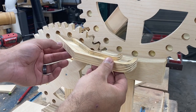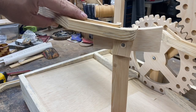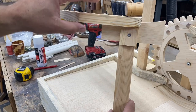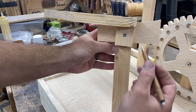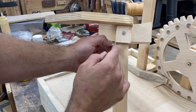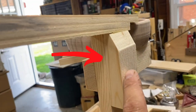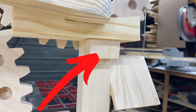The easiest way to get the angle just right is to glue a small block of wood to the bottom, drill a hole down the center for a screw, and then you can pivot it up and down to get the exact angle. Once set, I'll mark two sides with a pencil, pull it apart, put a little wood glue behind it, screw it back together, and it's locked in place. For features where CA glue is the only thing holding it, I like to add a small block of wood with glue on the back and top surface for two points of contact.